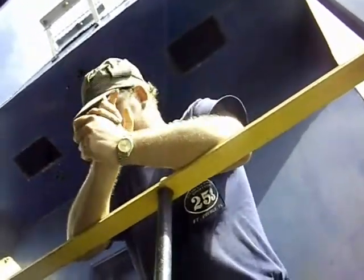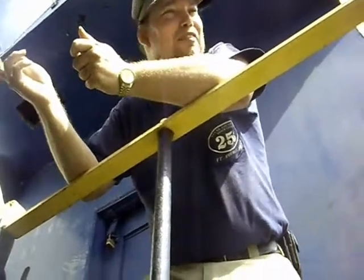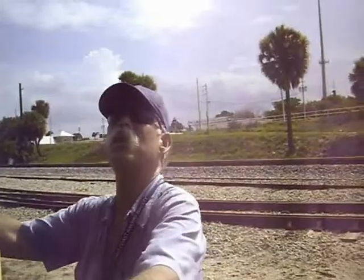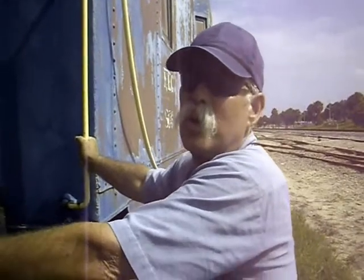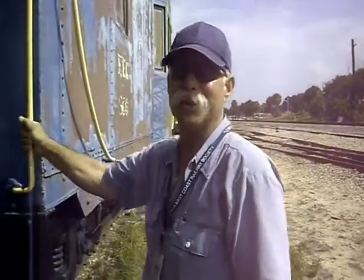So the old Hollywood movie where the train runs away because the air brake line came apart is kind of inaccurate, because they do actually stop if the brake line parts. It puts the train into emergency brake mode and locks up all the brakes. Today's train brakes are very, very safe, providing one thing, and that is that you start from your initial terminal with a full train load of air. You do that, and the train line parts, as Tom says, the brakes come on and the train stops. Great idea. Thank you, Mr. Westinghouse.